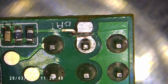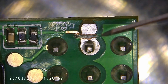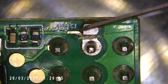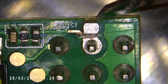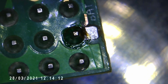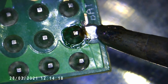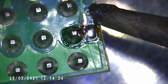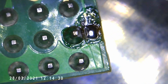With things cleaned up, I will check for continuity between here — I think it's fairly clear. We can see the fibreglass there; that is no longer connected. I've cleaned off the end of this trace. I can then apply solder to both of these and attach the wire. Let's re-tin the Channel 1 pin there, and let's go and put some solder on this pad here.